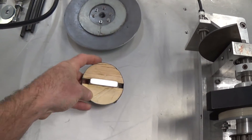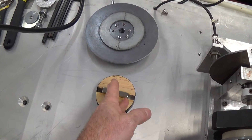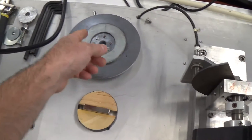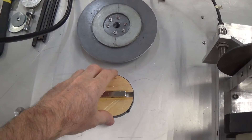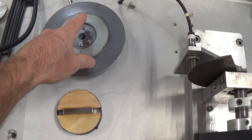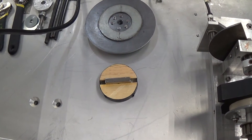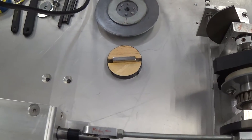It was a rectangular magnet like that with another rectangular magnet turning this way. But I found that didn't really have much torque, and I'm quite sure that the advantage would be to have a full magnet in a circle like that. Floor has concluded the same because he has recently shared that in the topic. Getting ring magnets that are magnetized half and half like that are very rare, and that is the difficulty. I wanted to experiment with that particular geometry, and this is what I've come up with.